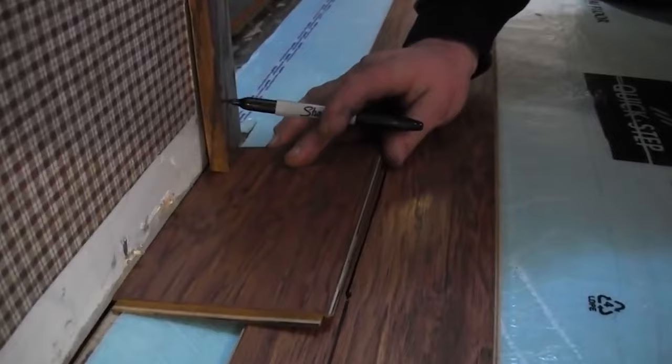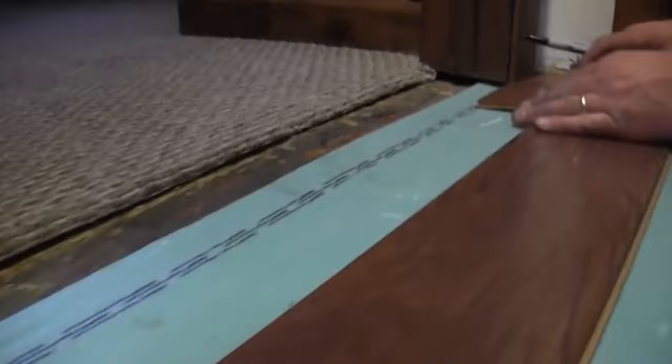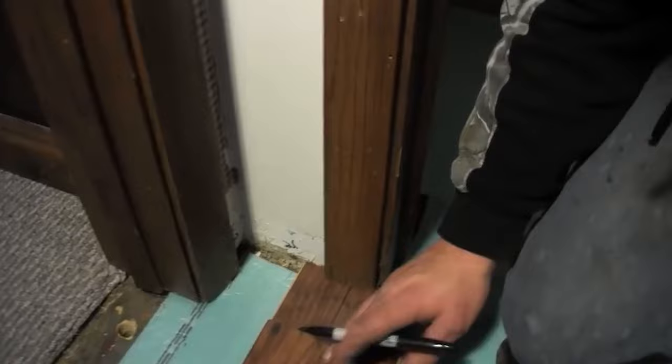I go right underneath the door jam where I cut it and stop just like I showed you, then draw it straight. This board isn't going to make it all the way — we'll have to put another board in there later. I keep coming along marking this wall where it jogs. Down here I run it under the jam a little bit and eyeball it, then put the board on there straight and draw my line straight off.